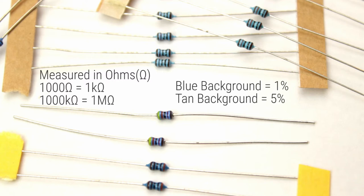As you're going through your DIY project and starting to solder your components, there's one thing you've got to keep in mind the whole time: is this component polarised or not? Polarised simply means that there's a positive and a negative side to that component. Some components are polarised, some are not, and until you get very familiar with the different components, you've got to ask yourself that question each time. Resistors are not polarised, so it doesn't matter what orientation you insert them into the PCB with.